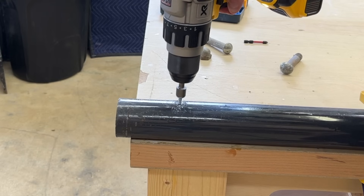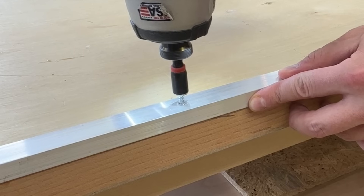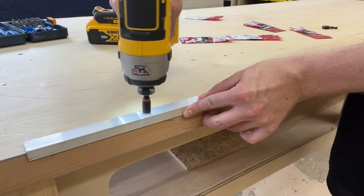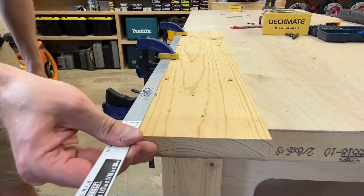When the hole is complete, the fastener sinks to the threads. Driving at the same pace will cause the threads to bite and cut. The head may also need to bore through a second surface below, but when the threads are set in that material, the components will draw together. Only drive until you're tight and then stop. Don't overdrive self-drilling screws because the pressure can snap off the heads. Once your components are tight, you're done with your connection.